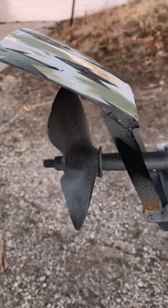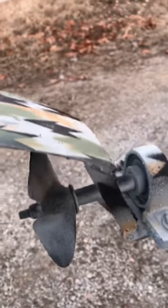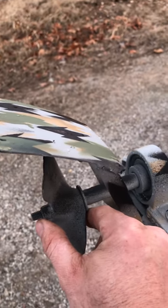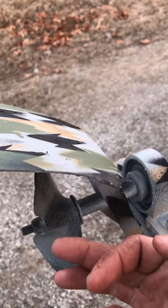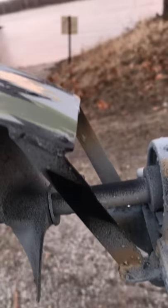The tough part is probably the prop. We used a 5/16" bolt, welded it straight onto the 5/8" shaft. This is a three-quarter tapered propeller. I have a lathe at home, and I took a piece of one-inch nylon rod and lathed it down to where it fit inside the taper shaft. All that's holding the shaft on is pressure — you just bolt that straight onto there, with a bolt sandwiching it in there.